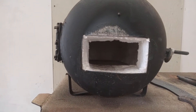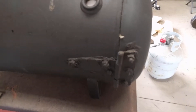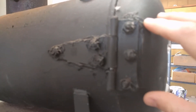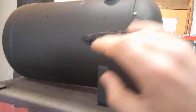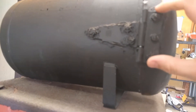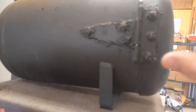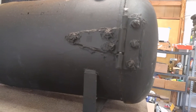Without a welder, I had to figure out a way to do all of the construction pieces — namely this hinge right here and the mounting for the propane burner. You may be looking at this and saying the weld lines absolutely suck, and you'd be right. This is all JB weld, so it's not going to be pretty. I used a lot of it to make sure it stayed where I wanted. This is a really simple Stanley brand door hinge. I used stainless steel screws — I didn't want anything zinc coated to off-gas any toxic chemicals. I probably spent 20 bucks in hardware, then bolted it in and sealed it up with JB weld, and so far it's been really well.